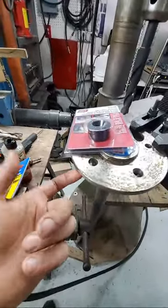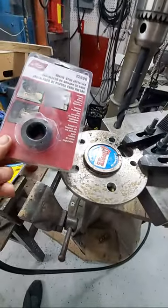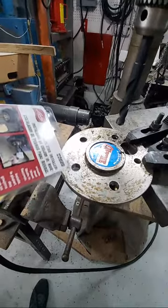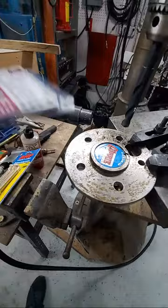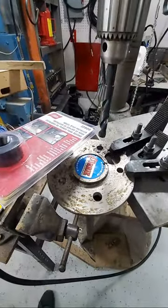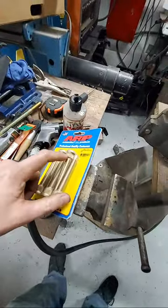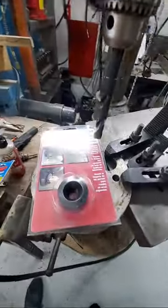Just keep an eye on the back until it's all the way seated. There's no special torque setting — it depends on the metal, how big the hole is, and the tolerances, and that's going to determine how easy it is. So you don't want to go too big on the hole. That's why you would never want to cut the hole the same size as the outside of the splines — you want to go a little bit smaller, and that's why 37/64ths for this particular stud.